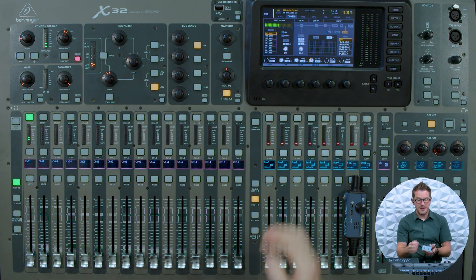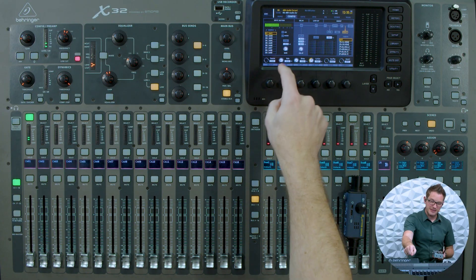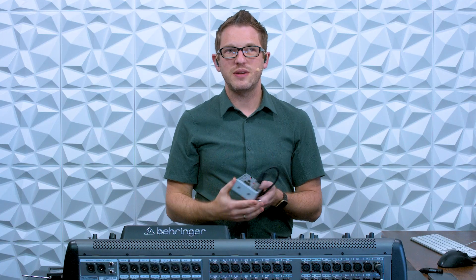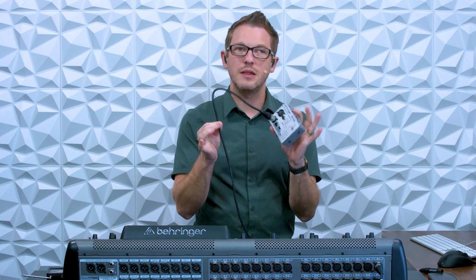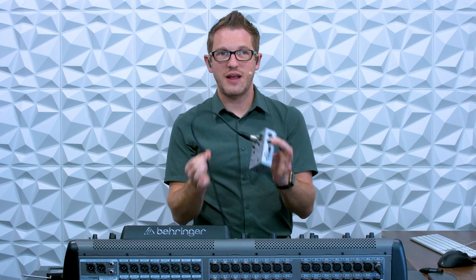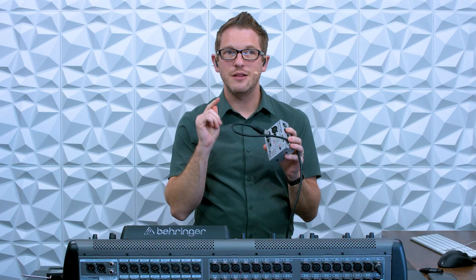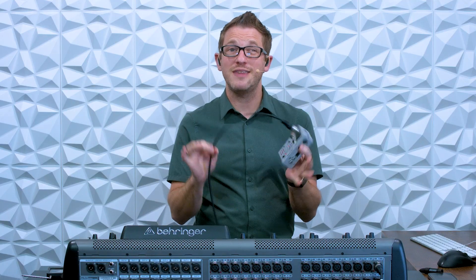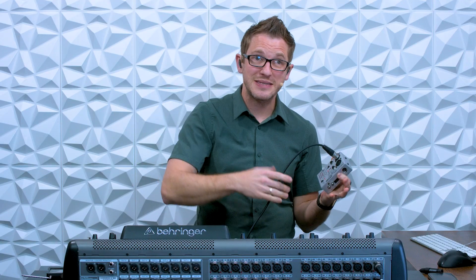If we set this to negative 10, this is going to be slightly below that, so we can verify that all of our inputs — if we set our gain to zero — are evenly spaced with our gain. One thing that's going to happen is if you have a cable that maybe has one line of that XLR cable broken, then it's going to come in slightly lower. So if we set this to plus 4 and we're checking all of our inputs, and all of a sudden one of the cables comes in slightly less with the gain at zero, that means one of those strands inside of your XLR is bad.